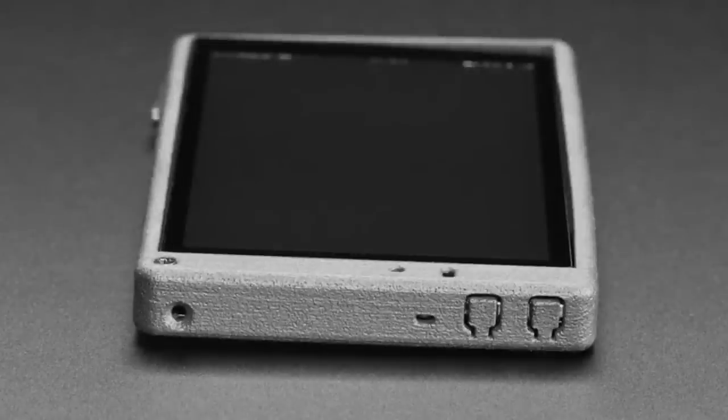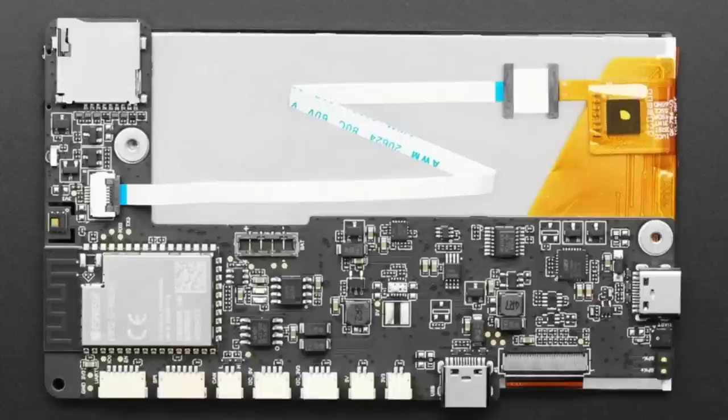But it does have a beautiful 4-inch capacitive touch screen with a 16-bit parallel port connection. There's all these connectors at the bottom, looks like JST-SH connectors for STEMMA QT, but also SPI and UART. It's got the ESP32-S2 module, so it's got Wi-Fi and native USB. It's got another USB port for the debug console and programming, so it's kind of good for that. Got capacitive touch. A couple of sensors. I think there's an infrared thing. There's battery management. They don't ship it with a battery, but you can grab an iPhone 5 battery off the shelf and apparently it just plugs in. To make shipping easy, it doesn't ship with a battery.